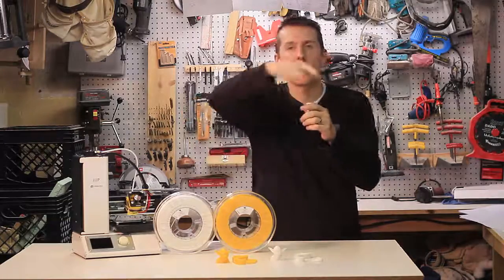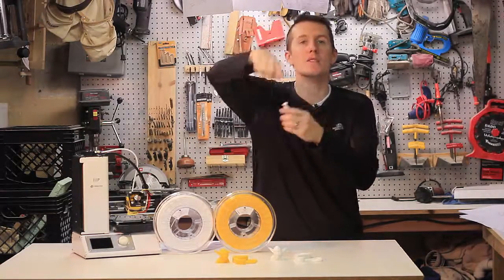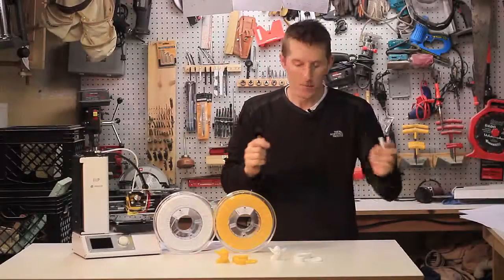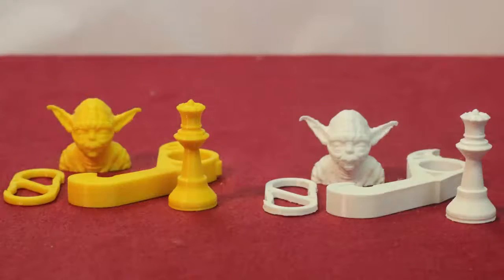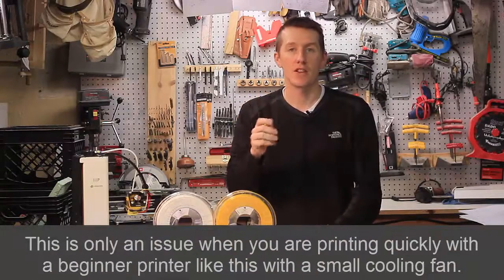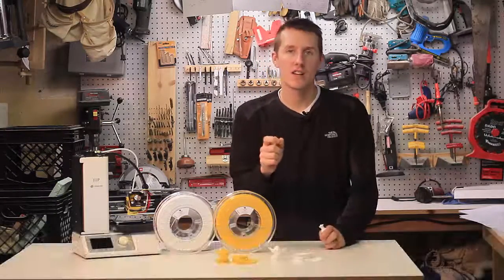When my printer would stop, do a loop around, and raise the print bed over a long distance, a little bit of filament was coming out. But once I realized it, I printed several test parts to dial in the right retraction speed and distance. Once I had it dialed in for this filament, it printed great. The runniness is an advantage for how well it looks, but you do have to account for it a little bit in your retraction settings.